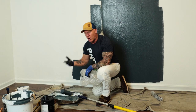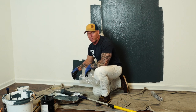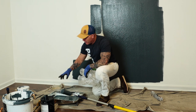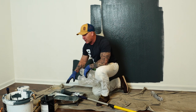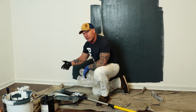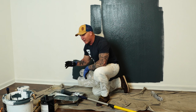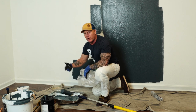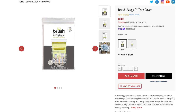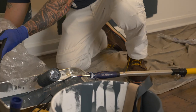Here's another don't: you don't want to leave your paint exposed for any length of time. If you're not going to be rolling for about 30 minutes to an hour, you want to cover your bucket and your pan because the paint's going to dry pretty rapidly on this roller and ruin it. I'm using a really expensive ultra micro roller from Premier, so I'm going to use it for multiple jobs — I don't want paint to dry on it, or on my brush or four-inch roller. I use brush baggies and reuse them. Some people use trash bags so they're not wasting plastic.